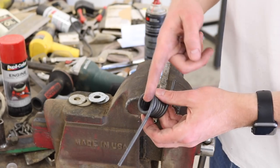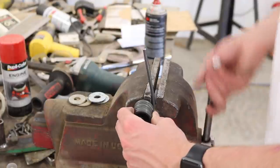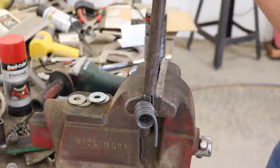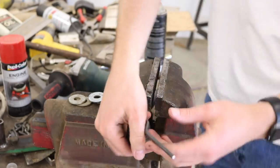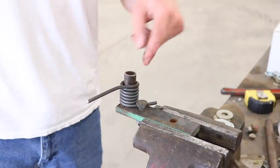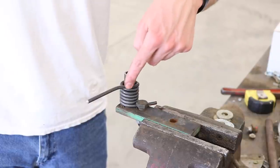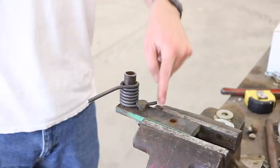In order to fit correctly this piece needs to bend out about here. I'll clamp that in the vise and use a piece of pipe over it to bend it — this goes in the opposite direction of the coil. I forgot to take this bend into account, so I should have had this piece and the tail parallel on this side and instead I have it parallel on the other side. I'm going to have to bend this a little more to make them parallel.